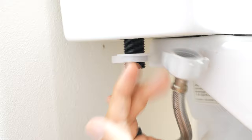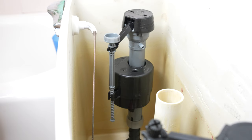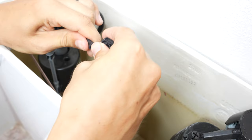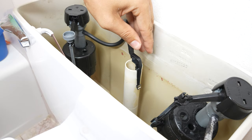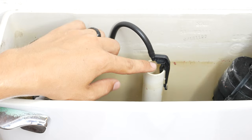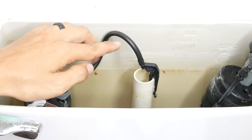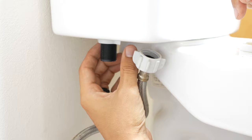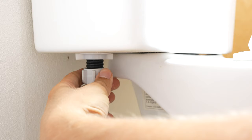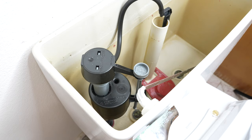The locking cap goes on first. Before I tighten it down, I want to make sure that my port lines up. The new kit comes with a little fill tube that goes on this port right over here, and you want that to be facing the overflow pipe. Go ahead and slide that on, then put the clip on the other end and clip that onto the pipe. You want the refill tube to line up right with the middle of the pipe. If this little hose is too long, you can always trim a little piece off — if it's getting in the way of the lid not closing all the way, you can cut a little piece off. Once everything up top is lined up, secure it all the way.